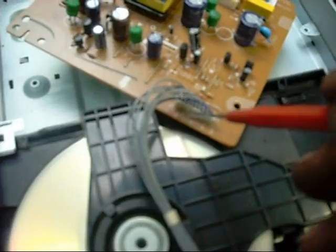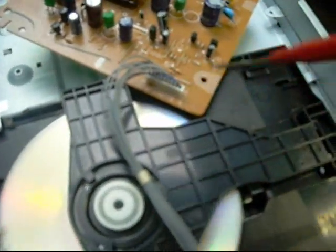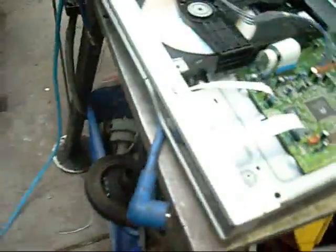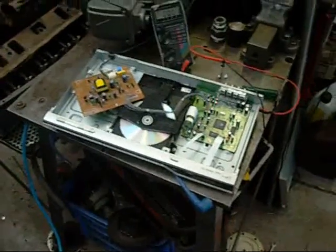5.6 volts, 5 volt, 12 volt ground, 3.3, 3.3 ground. Nothing about 170 volts. I say the power supply itself is fried and it's just putting out way too much juice. Although it is playing, doesn't seem to mind. Oh, another unusual one. I'll just put it in the too hard bin for now.